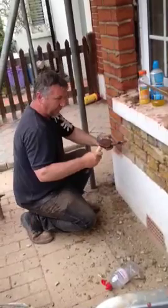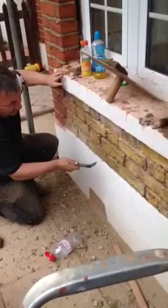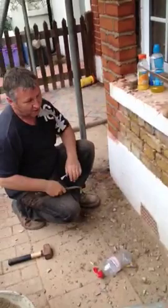And that's it. You open it all out so you get a good depth. And you wet it down, you brush it out, wet it down, and you're ready to start pointing.